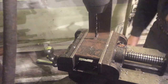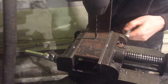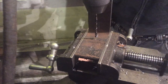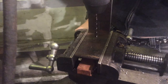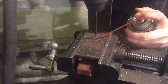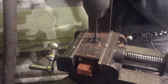You want to make sure you have the proper alignment with your hole. This is mounted in a cross slide vise — I like it because it allows you to fine-tune your adjustment for hole alignment. Clamp your piece in firmly, make sure it's elevated so that you're not drilling straight into your vise jaw. You can always put a piece of support wood if you're worried about that. Then just a light touch down to make sure you get chip formation. Once you've got chip formation and you've assured your hole is in the right spot, add your lubricant and gently drill through your hole.